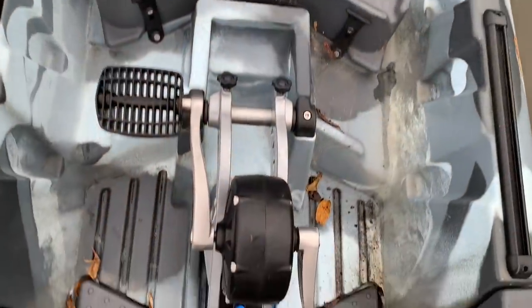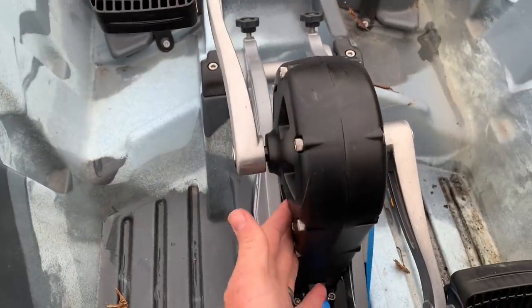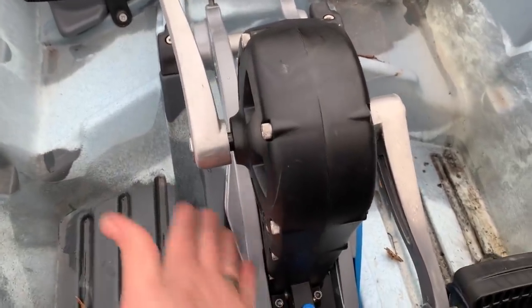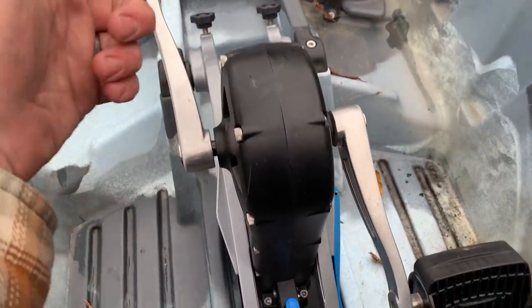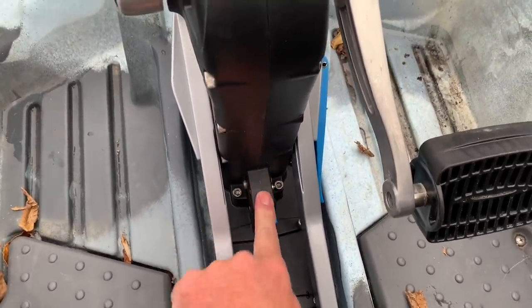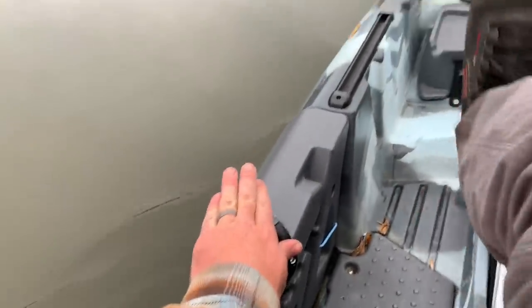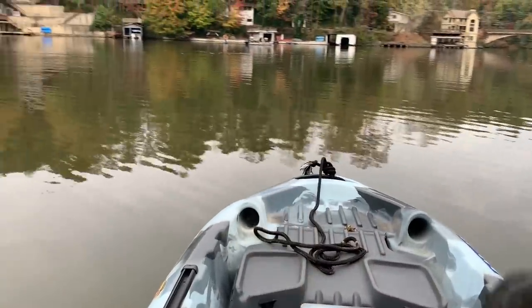This is the meat and the potatoes — this is the drive. The difference with this drive from any drive I've ever seen is it's chain driven. There's a gear up here, it runs in oil, it actually floats, and then it goes down to the prop. Fairly easy, fairly smooth. You've got this little eight-ball controller here — push to the left and it comes around super smooth.